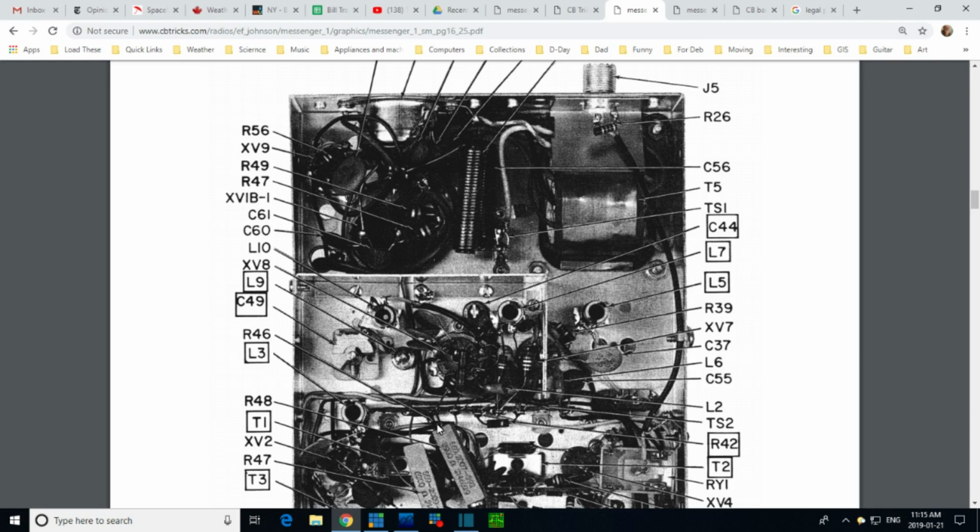Like smart guy, I removed the connection. Okay, I've got to put it back on. And this one, there was some instructions about the polarity of the meter going on there. R46. Interesting. So the manual tells you to read the voltage drop on this 100 ohm resistor, and I figured out the same thing. Wow, pat on the back, Jim. You know, probably I read it, and that's really where I got it from. So one side has a capacitor hooked up, and the other side is just resistors, and that's how I can tell which way is which.